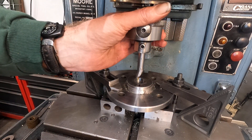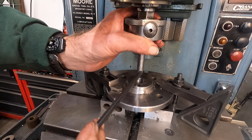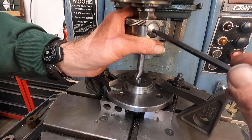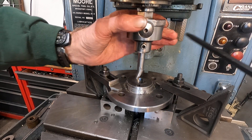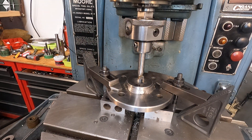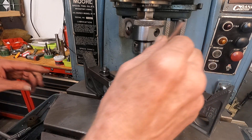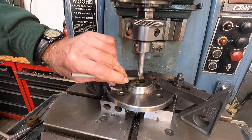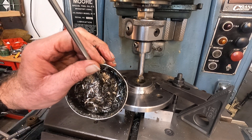I'm going to feed that tool in two thousandths — that would be four on this dial. I have to get the light just right. That's about right there. I want to see what happens. Get a little bit of lube in there — this is my beeswax Castrol Moly-D and other cutting fluids mixed to the consistency of grease.